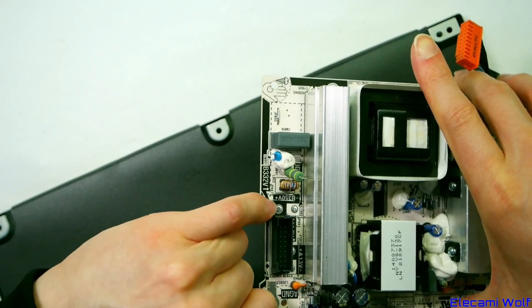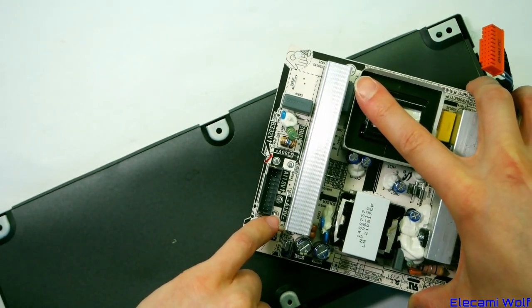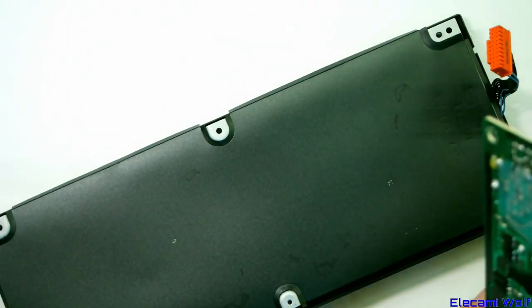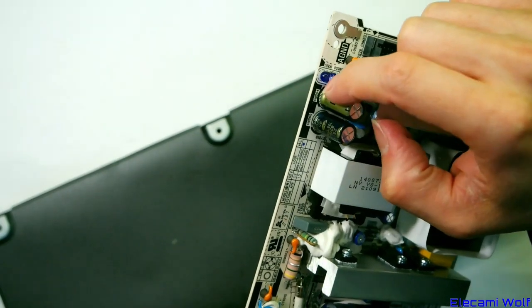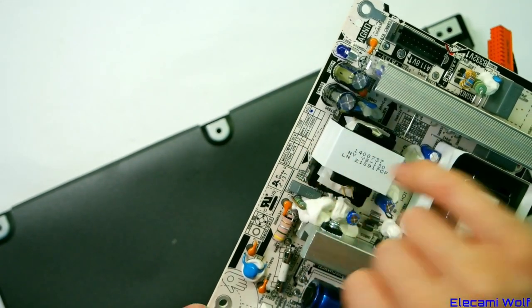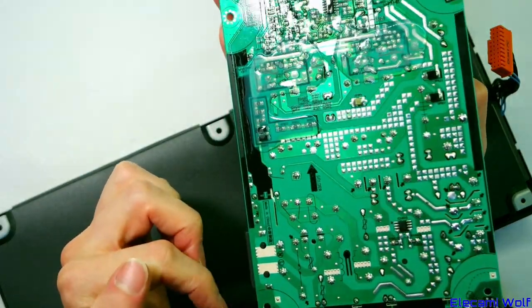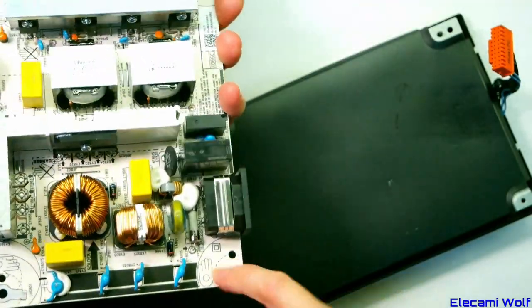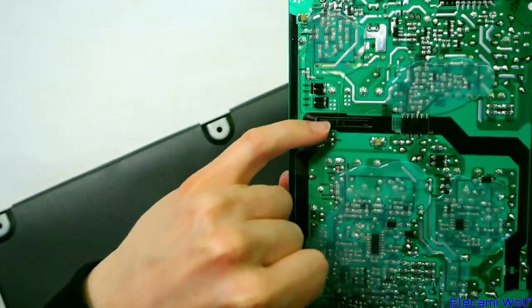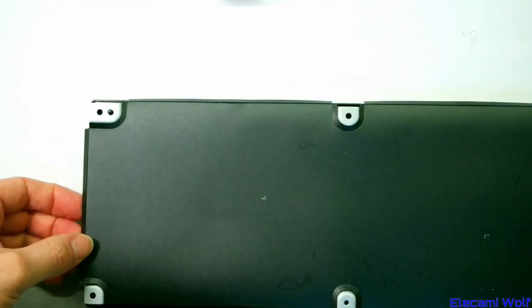There's the analog auxiliary — probably 13 V plus and minus. There's an IR emitter to shine out and repeat IR signals received by the TV. A chart tells us the revision but still doesn't tell us the input rating. They've got proper 8 mm creepages for double insulated, the double-insulated symbol, and the transformer even has a barrier coming through the board to help with the creepage, with a slot under the optocouplers — they've done a good job getting it to comply with the standards.